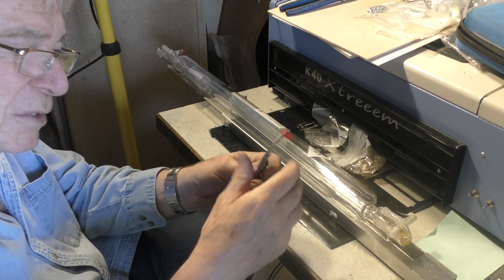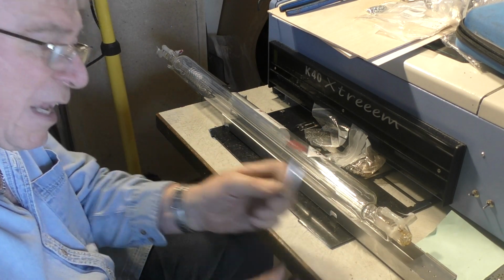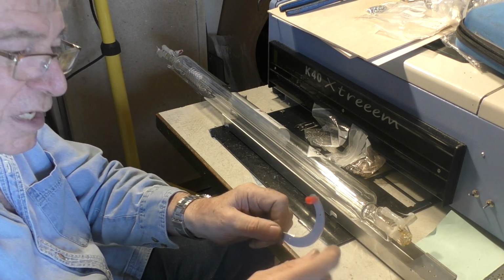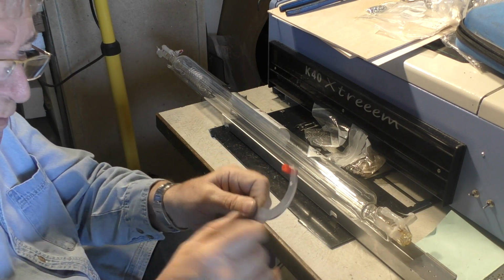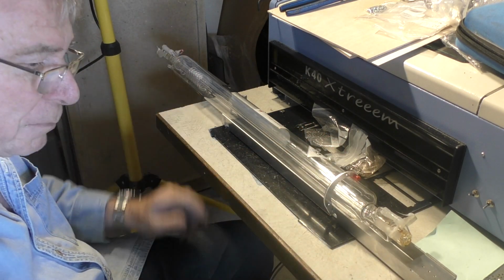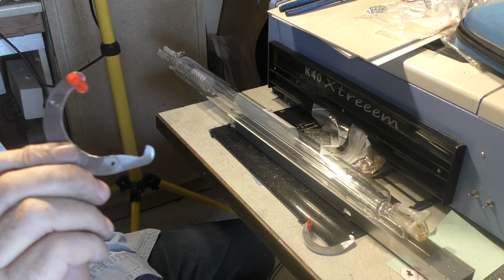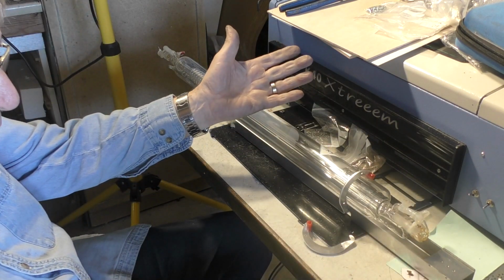So there must have been some flex in the acrylic that I used that isn't here in the aluminium version. So what I've had to do to solve that problem is to actually manually modify the shape with my Dremel. And now, beautiful. But I will modify the drawing so that it doesn't happen in future. The good news is that I only need 1 of these, not 2. They're totally strong enough on their own as a single item to do the job.